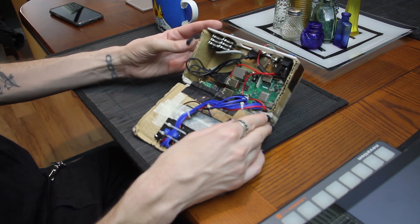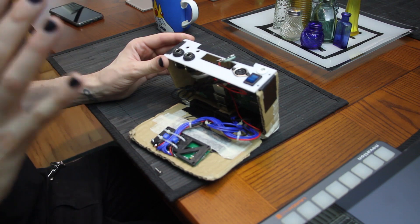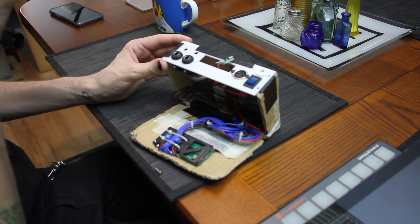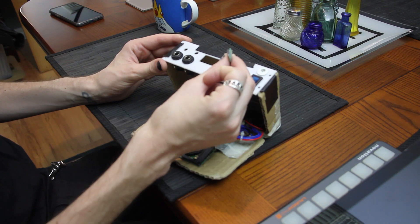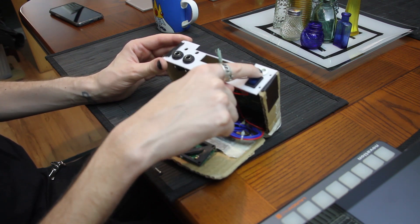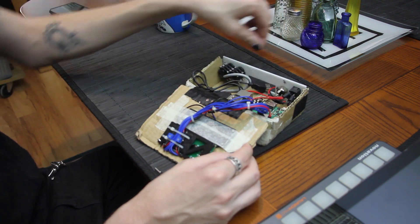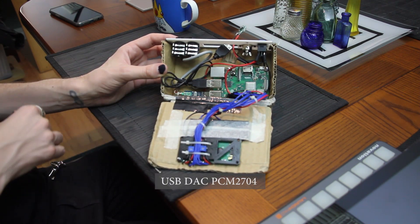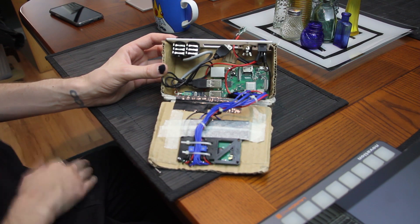And that's all the wiring. The back panel is 3D printed — I printed it for a Zynthian, which is another Raspberry Pi powered project I never got very far in, but the panel works really well. MIDI I haven't hooked up yet, so I've just been using a USB to MIDI connection. There are two audio outputs, and it's powered from a 5-volt micro USB. I have a small audio DAC in there which was about $3 when I bought it — about $5 Australian now.